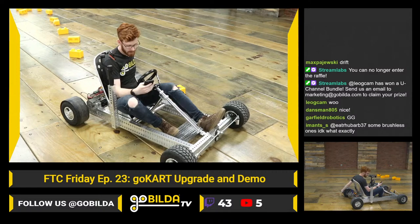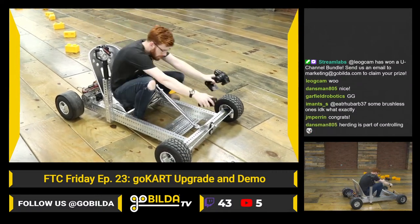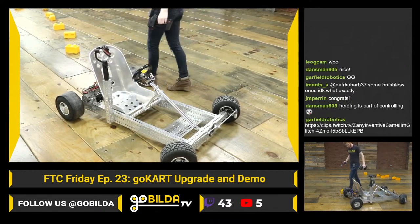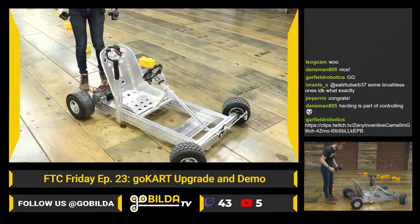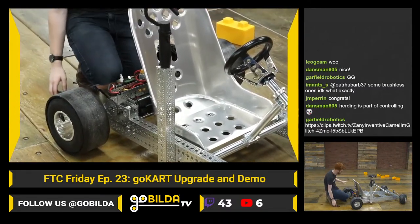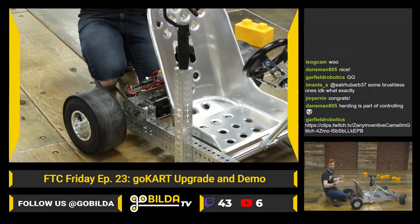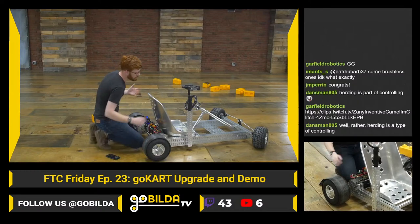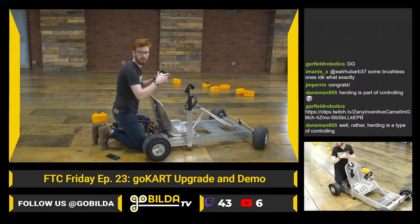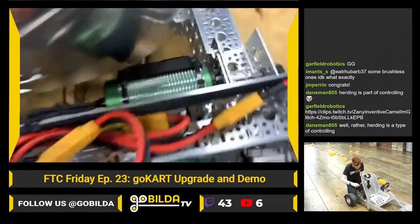Let's see, somebody asked about the motors. Yeah, what are the drive motors? We can definitely look at those here quick. They are Castle Creations 2028s. They peak at about 10 horsepower. In this application, they're pulling nothing near that. It looks like our peak was 528 watts of electrical power. That was the most power we pulled. Really, they wouldn't end up anywhere near that much in actual applications like this.